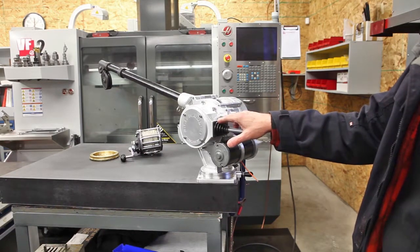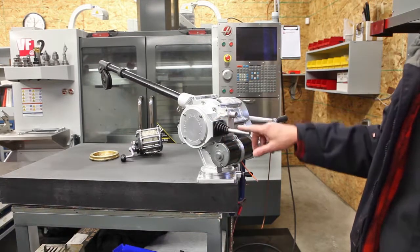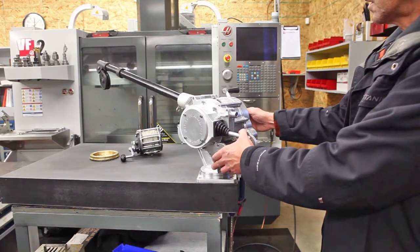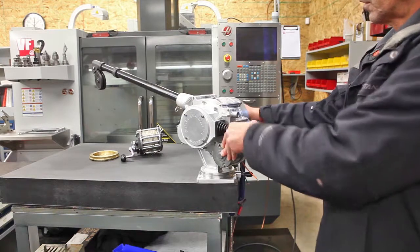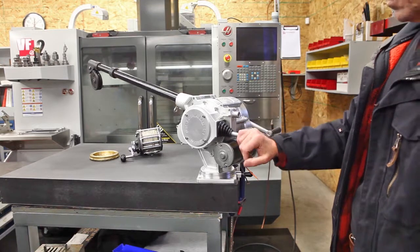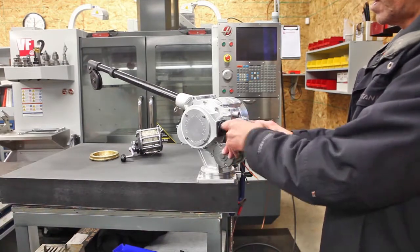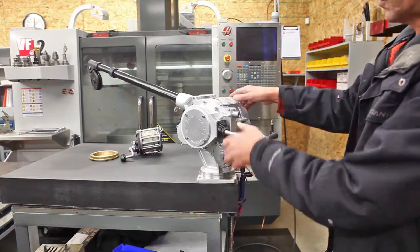Through all 4 modes of low, high, manual, electric drive, or freewheel, you have a brake. The brake, you can play the fish at any time. It's a self-energizing system. And in freewheel, when you go freewheel, your line is falling. You want to stop, you just apply the brake, or you want to slow the spool down. At any time you can apply the brake, and it's full function through any of the gear range. In the freewheel, you can spin, brake, you can't spin.